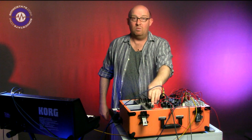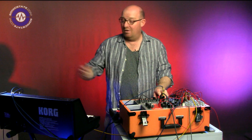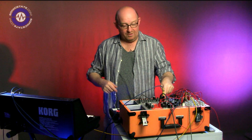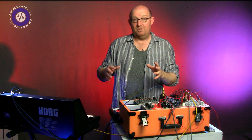The thing about the Gidonian is it converts in both directions. You can send CV Hertz volts from the MS-20 to Eurorack and it'll scale nicely, and you can do it the other way — volt per octave to Hertz volts — and it'll scale nicely. There are also some other issues which I will demonstrate.